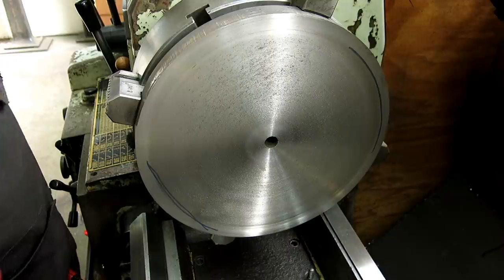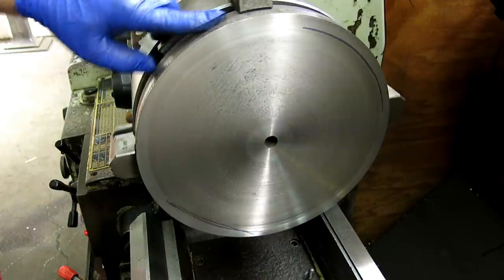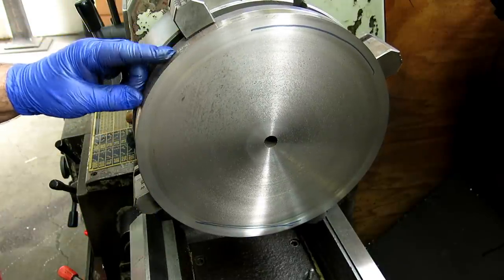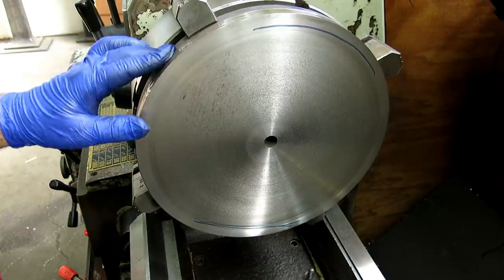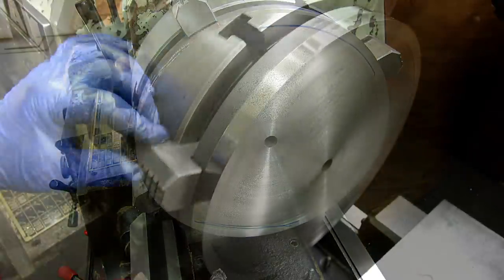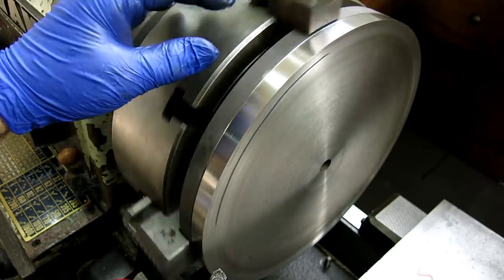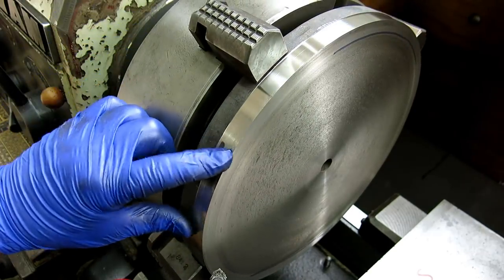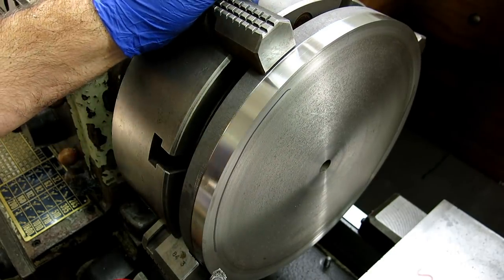12.0550, enter. Okay. All right, so we'll just take it down to 12, as close to the jaws as we dare, and then we'll flip it over and dial it in, and see if we can get a decent blend. And if we can't, we'll put a groove in the middle. Let's see here. Okay, there's a spot that didn't quite clean up. We're still 13 thou oversized here. So it looks like one little spot didn't quite clean up, and hopefully we'll take another 13 off of that,